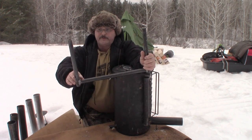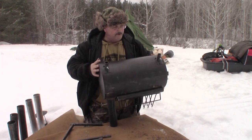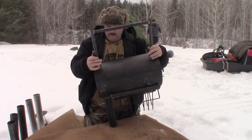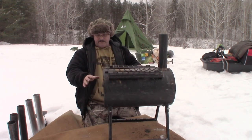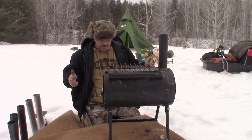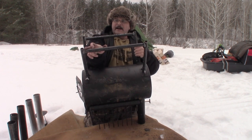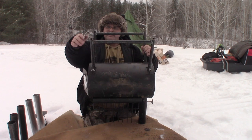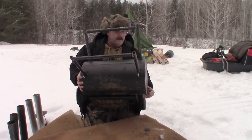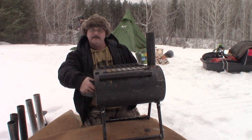So what I did for the legs is I fabricated a much shorter leg that connects both pieces at the same time. I'll insert one now just to show you — it's much more stable because the two connecting legs are connected together. This lowered the stove to the appropriate height. I left the pipe sticking out a little extra on each end so it would dig into the ground — snow, gravel, dirt — preventing the stove from sliding away when you open the door and load wood.